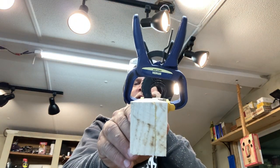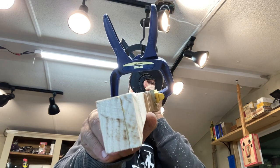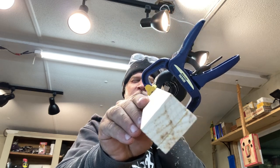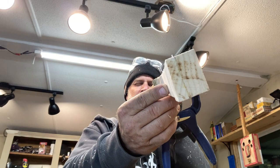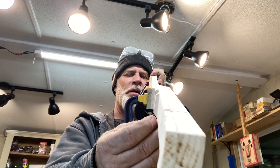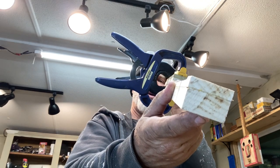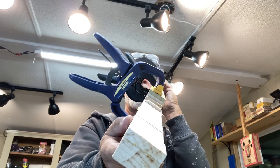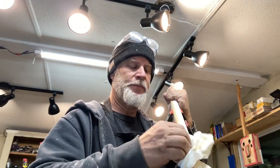After about 10 minutes, then what I do is I just verify that the neck is straight on all axes. Continue to wipe excess glue if necessary, but I pretty much got it to where it's stopped oozing the glue out now. But keep it wiped nonetheless. You can even hit it with a damp cloth.